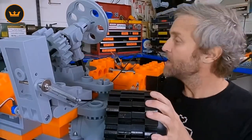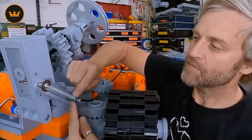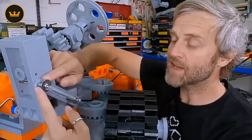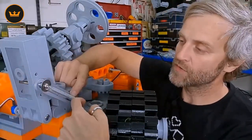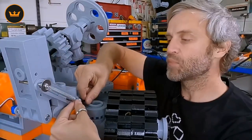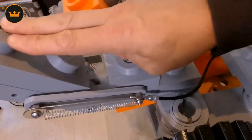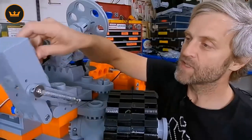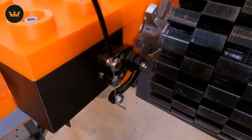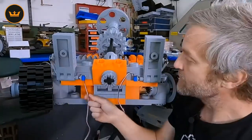While I'm waiting for the new parts to come in — I've ordered new batteries and a motor — I decided to tackle the brake system. I've added this brake cable in place and made up some parts to attach the cable to the pedal and the rear assembly. I've kept it pretty simple: hexagonal spacer standoffs drilled through and screwed into the back of the plates with the cable passed through them. I also made my own cable brake adjuster out of an M5 bolt. This piece here stops the brake pedal from going too far — I've actually got a modified version of this now which is a bit better — and of course a spring to return the brake pedal. There's also a spring already on the caliper at the back which returns the caliper into position, so that's working really nicely.